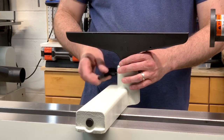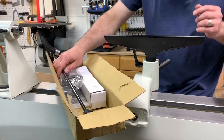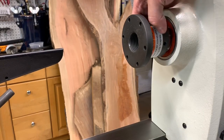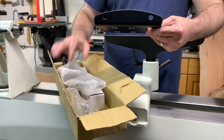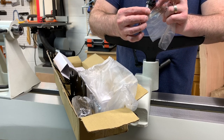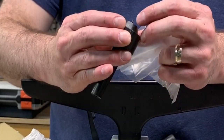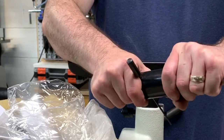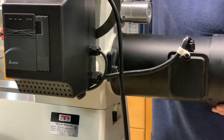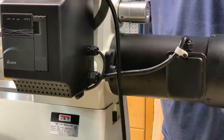The banjo seems similar to the Powermatic banjos to me. This one has a cam lock on it, which is really nice to not mar the one-inch tool rest posts. As for the accessories, it came with a nice drawbar, a wrench for the face plate which has locking set screws for reverse. A nice steel accessory shelf was included, though I'll probably hang that on the wall. It came with an extremely sharp four-pronged spur drive center and two live centers — one cup and one cone. The cone center has a center pin that goes into a hole, and you can actually remove the cone. The lathe does have a sliding headstock, but no longer has a 360-degree spinning headstock — they did away with it.